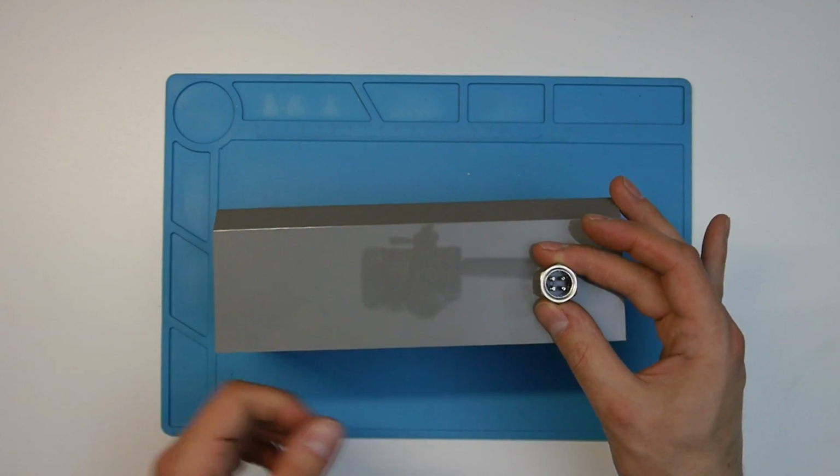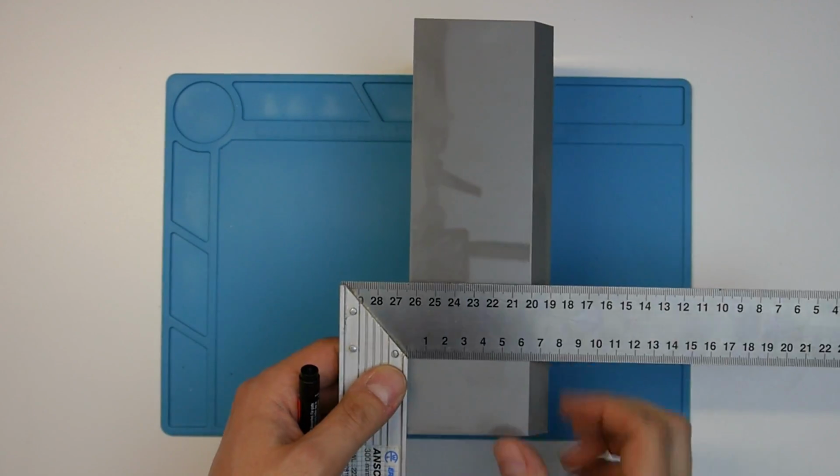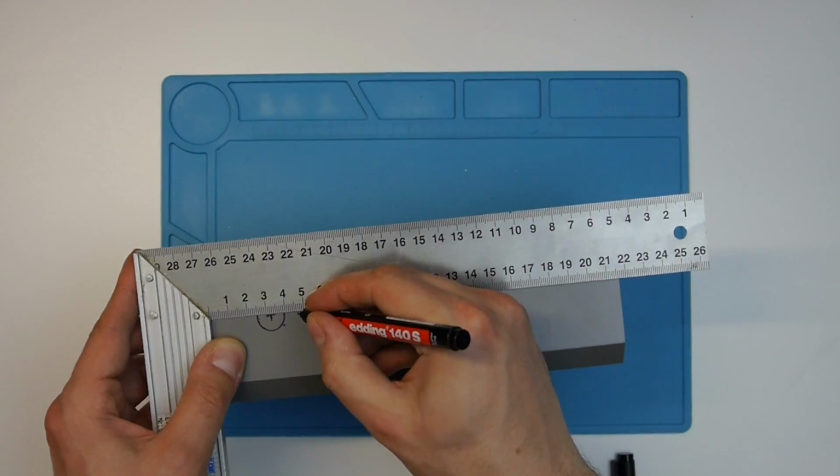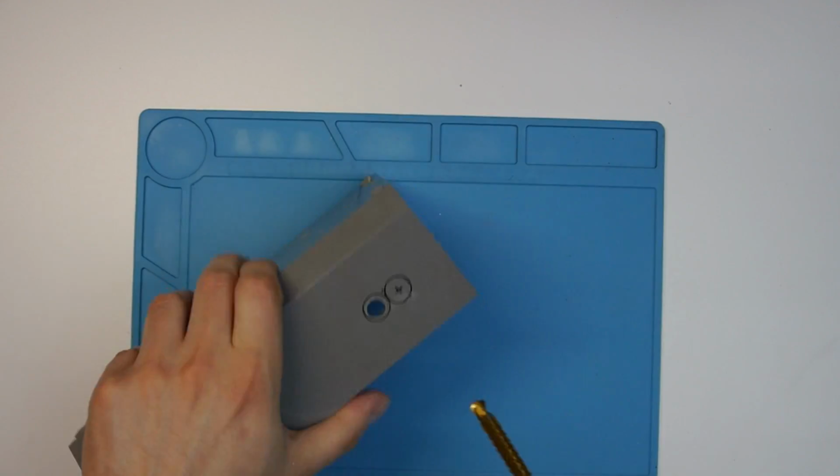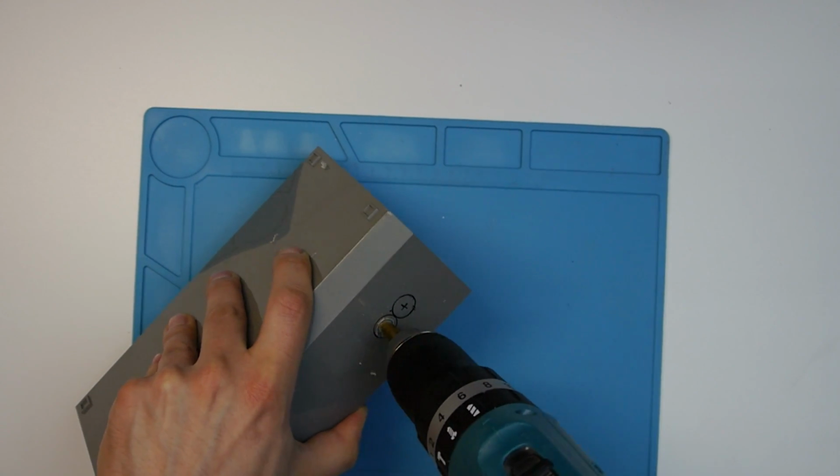To connect the panel to the printer, I'm using a 4-pole GX16 aviation connector. It needs a hole a bit larger than my largest twist drill, so here I'm using a kind of slot drill to enlarge the hole until the connector fits inside.